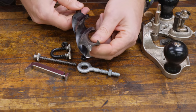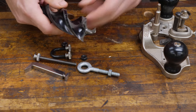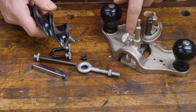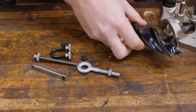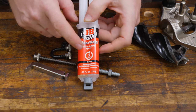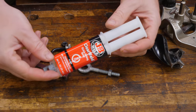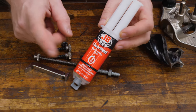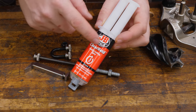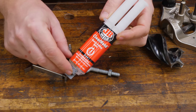You're also going to want a large auger bit — about an inch and a half to two inch — which will create the mouth and opening for the bit to go into. Then you're going to need some five-minute epoxy. Normally I would want to use something a bit better like a 30-minute epoxy, but for the sake of the live video I'm going to use five-minute epoxy. You can follow along with that, or get up to that point and then do the rest later. It'll actually do rather well for this.